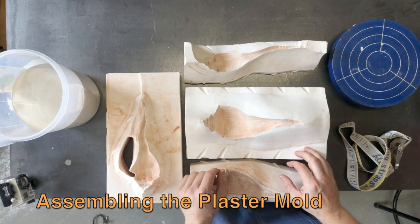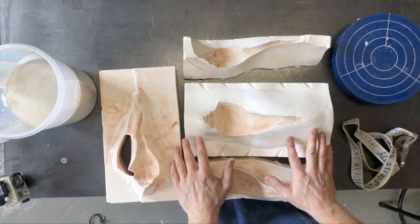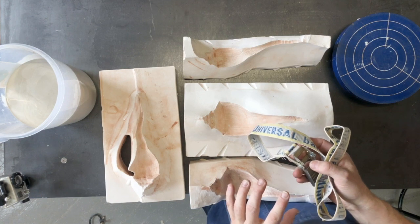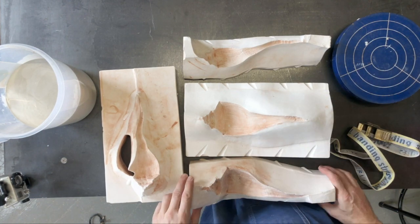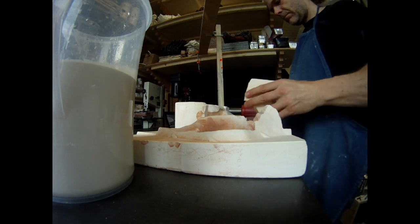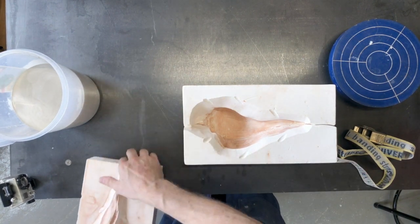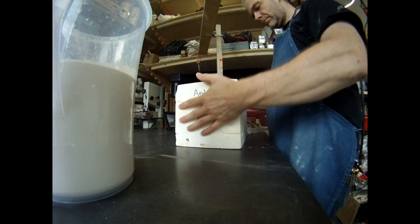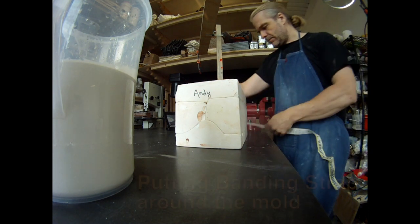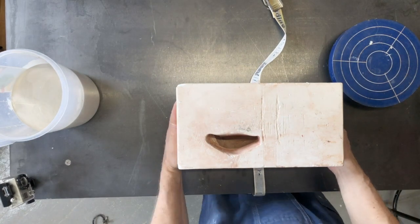I've opened it back up and taken the shell out. First I've got to put the mold together and then use the banding strap. This is a strap that clamps the whole mold together so the pieces don't fall apart when we put the slip inside. Another popular method to hold molds together is with large heavy-duty rubber bands — they work well on smaller molds. The mold needs to be held together; besides keeping it held tightly while casting, it's also necessary when the liquefied clay is poured out.